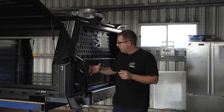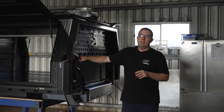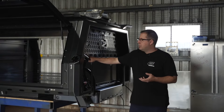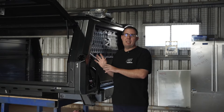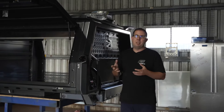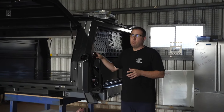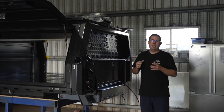So how are they secured? The headboard is actually bolted on and there's a few reasons why we do that. If you wanted to go to a different vehicle later on — say you go from a Hilux to a LC 79 and you've got a tray only and you want to take that across — it's a matter of bolting a new headboard on, new boxes and a new infill, change your patch leads out and you're good to go. Being able to get the headboard straight — aluminium is subject to heat distortion — so being able to bolt these on is a much, much better manufacturing process to deliver a better quality part time and time again.